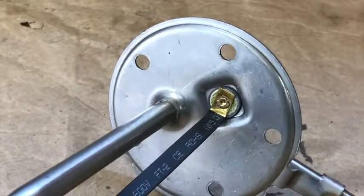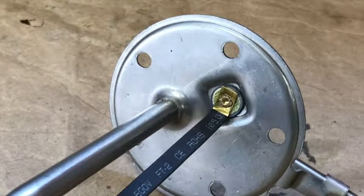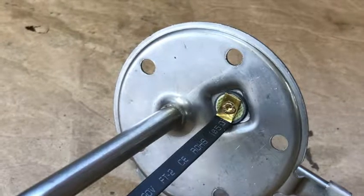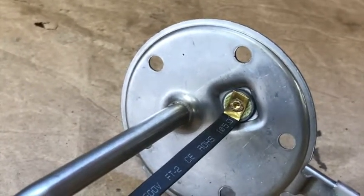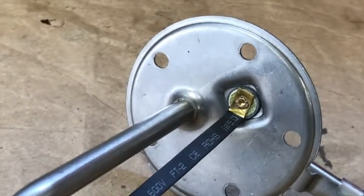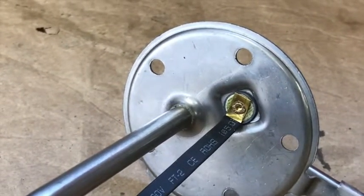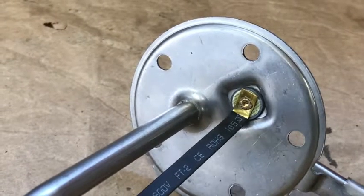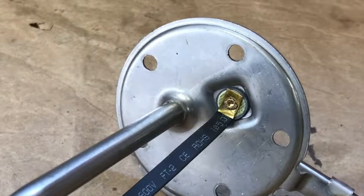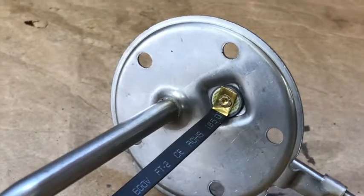So you see there what looks like a rivet on that back side of that stud. The stud is sealed going through there through that yellow nylon — it doesn't leak, that part's fine. What I did was I put the nut on the stud on the opposite side of this metal piece so that it was flush. I stood it up on the anvil on the vise and I used the center punch first and lightly center punched that rivet piece, then used a drift bigger than the little rivet area and peened it over a little more. So now it's nice and tight.